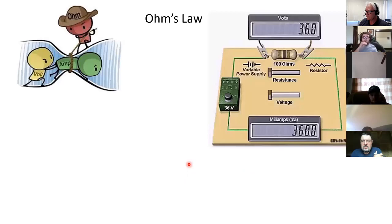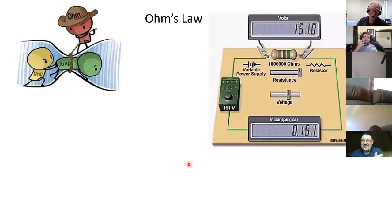Dave, is there sort of a rule of thumb for how close something should be before you'd be worried, like 5% or 10%? Well, if there is, I don't know what it is. Let's just say something's supposed to be 100 volts, and I looked at it, it was 95, but something wasn't working at all. I guess it depends on what the problem was. If something wasn't working at all, then 5% wouldn't be troubling to me. I need to look for something more significant. If something wasn't working as tightly or as precisely as it should, probably 5% still, I probably still wouldn't look at that very closely. But if it were down to 90, I would probably say, well, maybe this is doing it. But usually you don't come into those splitting hairs situations.